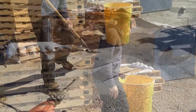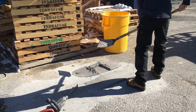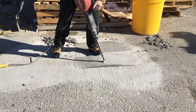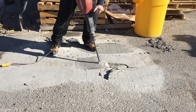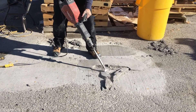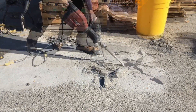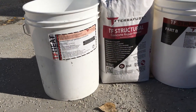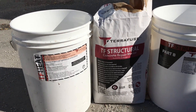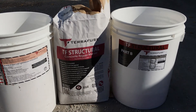Because it's just a demo to show you the heat, we're going to remove them. 30 minutes after install, it's still very easy to shovel up the product without the TF Heat as it is a very cold substrate. But again, as you can see the strength the TF Heat will add — I need a Hilti 1500 jackhammer to remove this product only 30 minutes after I mixed it. I hope you've enjoyed this video and the demonstration of what TF Heat is capable of doing for the TF Structural. If you have any comments or questions, please feel free to leave them below or contact TerraFuse directly. Thanks for watching.